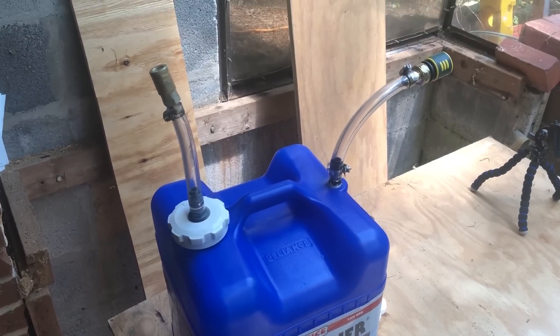On this end I have a standard water hose repair kit where you take the barbed end, shove it inside the tube, put the hose clamp on, and I've got a quick connect. Now the Achilles heel of my system is this one hole I drilled right there. I'll show you pictures of what it looks like — you've got a little nipple you have to cut off, then drill that hole, poke the fitting in, and thread it carefully with PVC tape and sealant. It works great, but once the tank gets low on fluid it's going to start to wobble, so you need some kind of foundation so the connection doesn't get bumped.